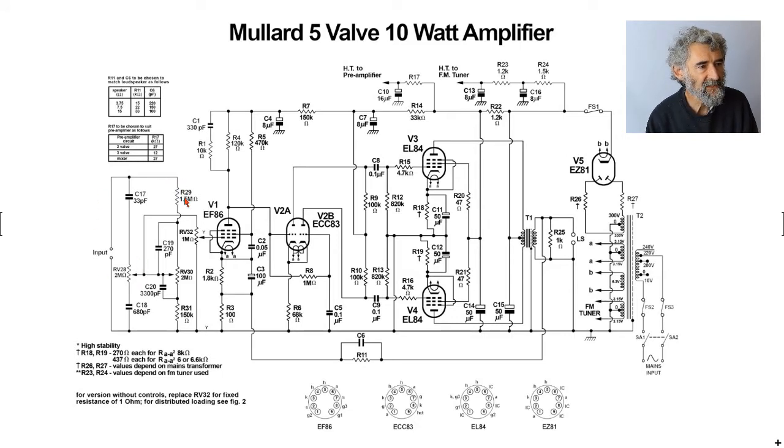The full range signal is fed in through a 1.5 meg into another 2 meg pot with 150k at the bottom end. Now, in this part of the circuit, treble is short circuited from the end to the slider of the pot, and short-circuited down to that 150k. So what you're left with is low frequencies across the bass pot. That is the boost end, that is the cut end, where you have a division of 2 million to 150,000.